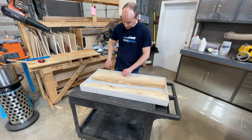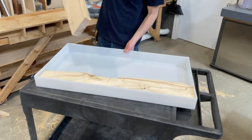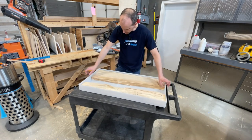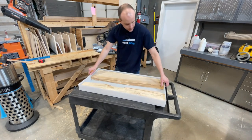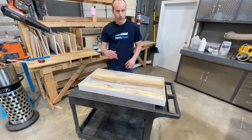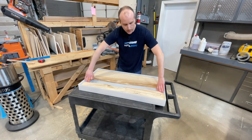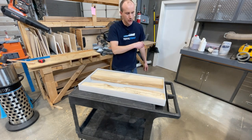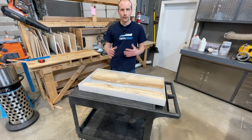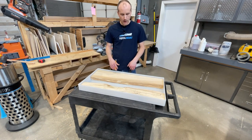Whether you're buying HDPE molds from us or someone else, these formed one-piece molds do not have perfect 90-degree edges. So your wood is always going to sit an eighth to a quarter inch away from the edge just because of the round radius. You could pre-radius the wood with a router bit to fit more snugly in the mold if you wanted to go through that effort, but either way you're going to trim the perimeter and plane it anyway. If you're really concerned about wasted epoxy, use a silicone mold for a perfect 90-degree edge, or just pre-router the edges.